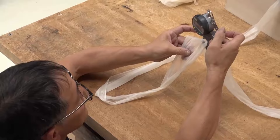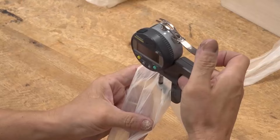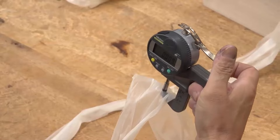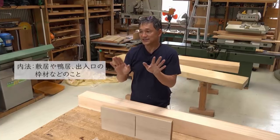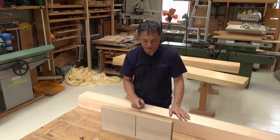The next shaving is 12. Then 10. This one's uneven — 9. I use this plane for members fitted to internal measurements, such as thresholds, head jambs, and door frames, as you always get a cleaner finish by planing in one pass rather than two.